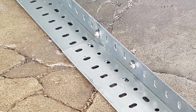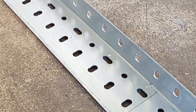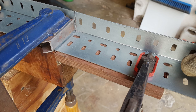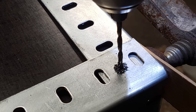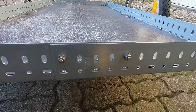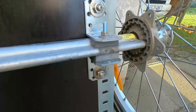I got sealed non-slip plywood that had the perfect size to accommodate a bit of margin between the boxes and the border of the trailer. For the border I used angle profiles made of galvanized steel with pre-drilled holes, typically used for constructing shelves. I brought them into form by cutting and bending them 90 degrees. Letting these overlap a bit gives the corner additional strength, and two of these angled profiles would exactly match their holes when wrapped around the plywood, giving it extra stiffness.